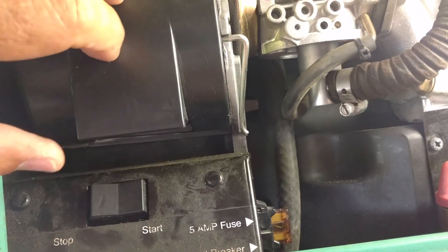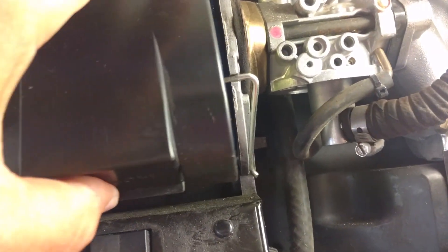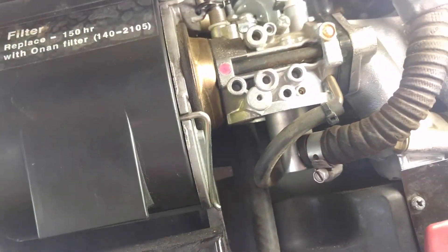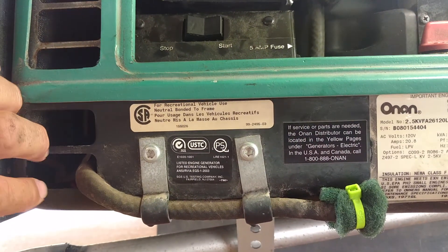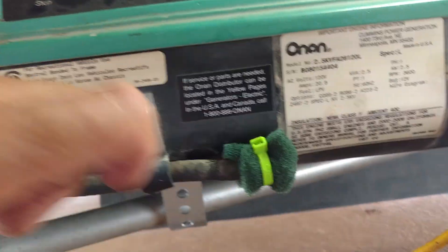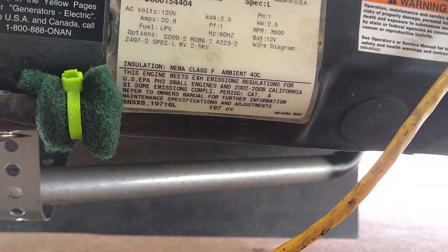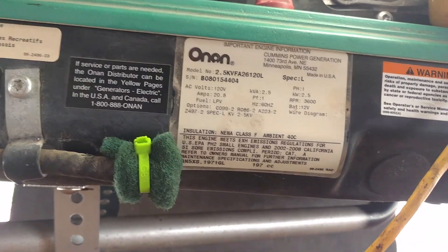The air filter is contained right in here. The cover comes off rather easily — and there's the air filter. There's really not much holding it on other than the cover and the insulation; the cover pushes up against it. This is the intake for cooling air here. This vent hose here will get bugs in it, and that's the reason I have this piece of Scotch-Brite pad wrapped over it and secured — to keep insects out of it. Because if insects build in it, it will generally not start. The exhaust exits and the hot cooling air exhausts out the bottom.